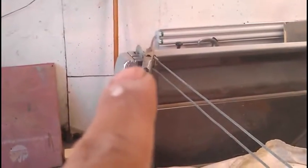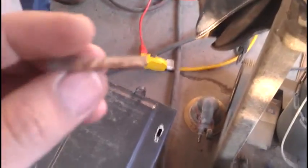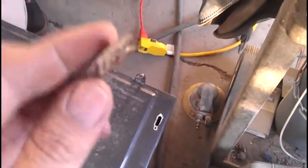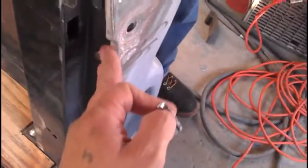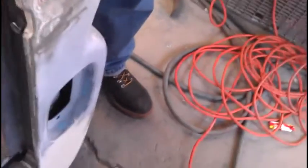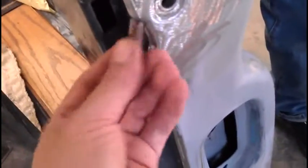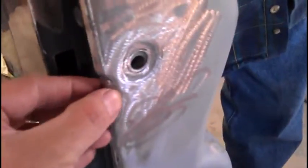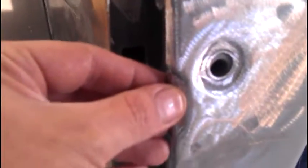You can see that little tape right there. There's that little piece that I just made — the one I was just cutting. I went in and cut it a little bit more and grinded it where I wanted it. This is actually going to cover this indention right there and make it flat. It only took a couple of minutes to get this in the shape that we wanted. I'm just going to fit it right there and then weld it in — you can see it looks pretty good.